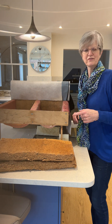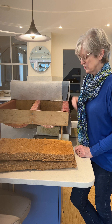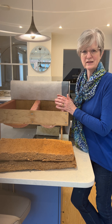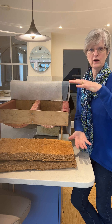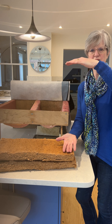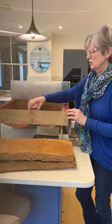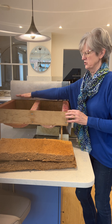There's been a lot of discussion recently on my feed about how you insulate under a suspended floor, and John's made a model so I can show you. If you live in a house built before 1930, you've probably got a suspended floor over a subfloor void. In our house the void was about this depth, and it's just earth underneath, so the joists go across and hold the floorboards in this direction.